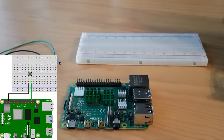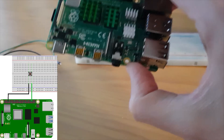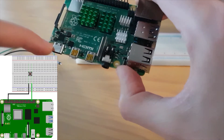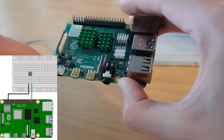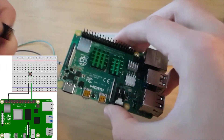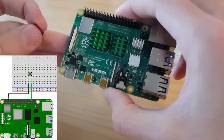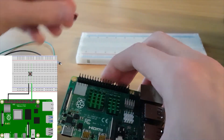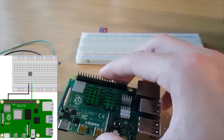Let's first create the circuit with the Raspberry Pi and the push button. First of all, make sure to power off — correctly shut down and power off. You should not have any power cable connected. You can also remove the SD card, because if you manipulate your Raspberry Pi with the SD card inside, you may damage it. So let's put it on the side for now.